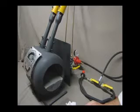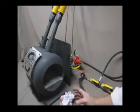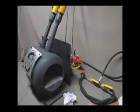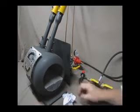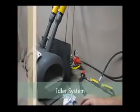Okay, and this is now obviously burning, and if it falls on, for instance, this table, everything will go up in flames. Now keep in mind that you are using LP gas, so be careful. You do not want to do this in your living room, of course. Use a well-ventilated area, preferably outside, shielded from wind. Nothing above the forge, nothing behind the forge. You'll notice on the forge feet, all four corners, there are places where you can permanently fix this forge. Please do so onto a metal work surface.